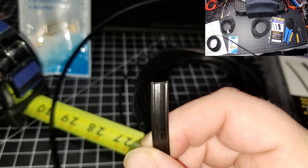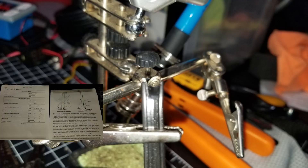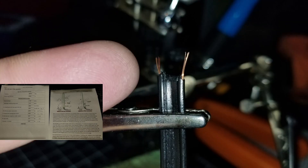So we're going to go off that printed sheet and start making our cuts on the window line — it's the old TV antenna stuff from the 70s and 80s. One of the first things is to pick an end and cut back the center part, leaving the copper so we can bridge that connection. At the very top, we'll bridge that connection with some solder. We cut back maybe a quarter inch or a little more between the two copper leads, strip the copper ends, fold them over basically 90 degrees, and solder across to bridge that.